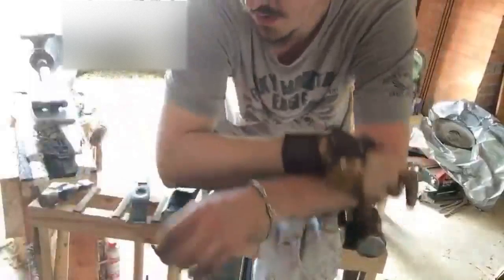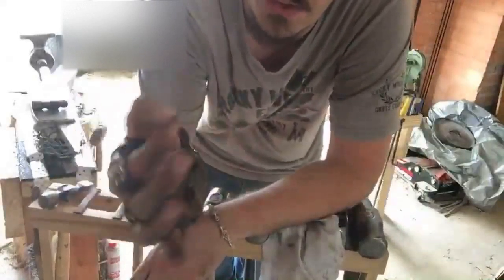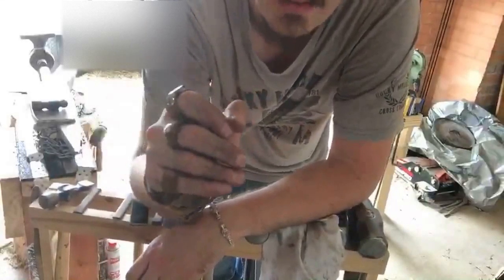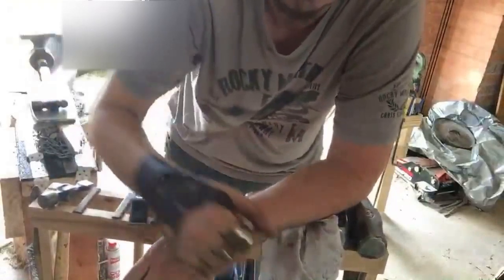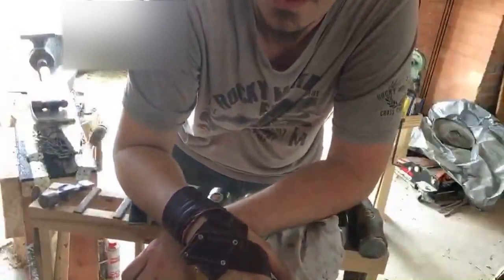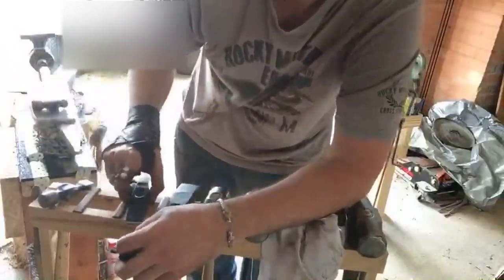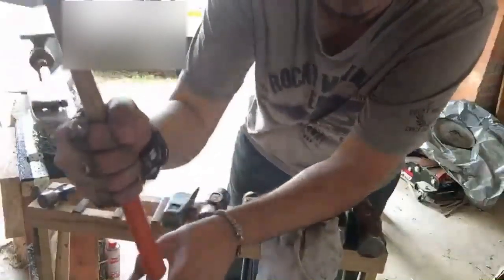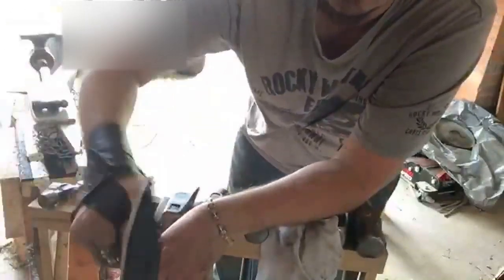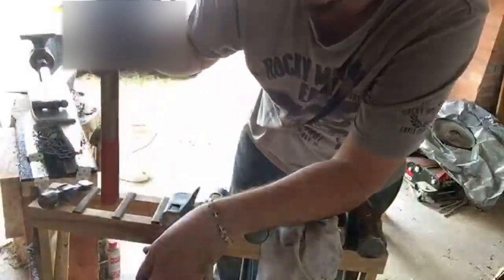Yeah, that's right. You'll tire much faster if you use your wrist while hammering. It's best to just keep a loose grip with your index finger and thumb. Use these fingers more for guidance. Then focus on lifting the hammer and letting the weight of the hammer come down. Just guide it with your arm. You don't get as much shock, because people tend to grip the hammer, ironically, really tight, and the shock of the blow just goes straight into your wrist. So you just let it flick and really use your shoulder and your elbow to get the flick that you need.